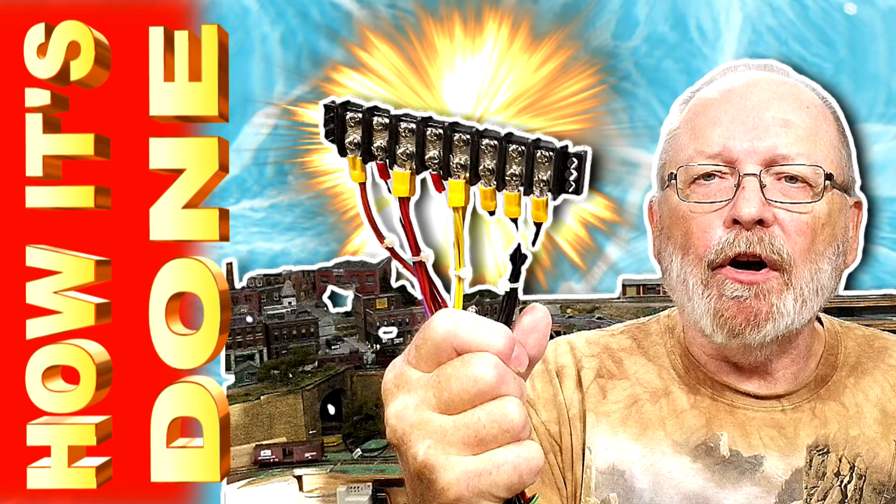Whenever you have LEDs, it's a good idea to look on the back of the package and see what the specifications are. The forward voltage on the red is 1.8 volts and on the green it's 2.1 volts. You want to make sure what your trigger voltage is — you don't want to apply too much voltage. Since it's 1.8 and 2.1, I'm going to be using the 3.3V off of my computer power supply. You could use a wall wart or anything to get that voltage, but check the specifications on the package first. Other LEDs may not be this voltage.